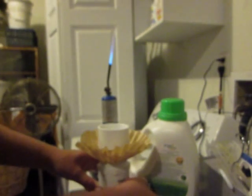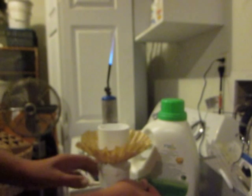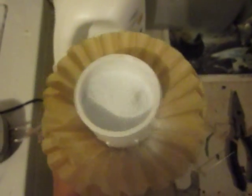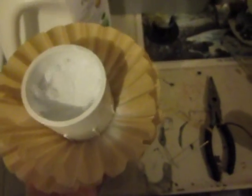and then you're going to open these up. Basically what this does, guys, is it turns it and makes that powder paint real liquidy, and it puts air into it, so you use a lot less paint. And then the excess that boils up like this, it goes right in here, and you just take this off and you put it right back in the container.